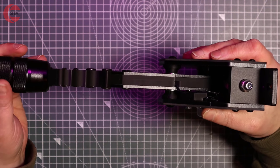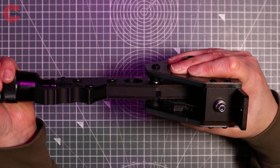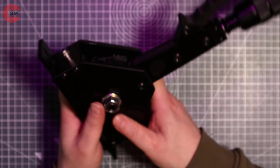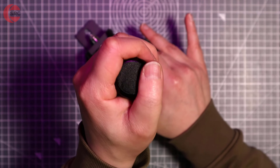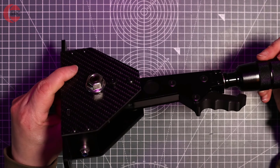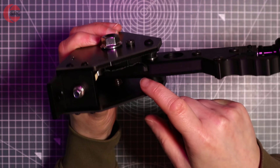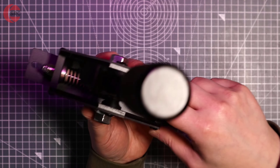There's a very tiny amount of play. I'd say it is stiff — you're not really going to feel that. Very, very tight, with just a tiny bit of movement there, but it's certainly not loose. Tension feels actually quite nice. It's not really adjustable. We do have these screws here and they push onto these ball bearings, and that's what gives the snap tension. You also have these return springs here.